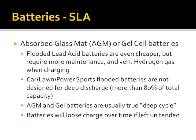This is important because, well, you don't want to spill acid on yourself, you don't want to blow up. So you choose these batteries for safety. They're a little more expensive, but they are inherently deep discharge. Avoid flooded batteries. You can go to Costco and for $60 buy a 200 amp hour marine deep cycle battery. It weighs 130 pounds, and if you tip it, it spills acid all over the place. It vents a lot of hydrogen, and you're going to need a high charge current to keep that thing charged. Don't fool with it. For portable operations, you want safety, go with this.